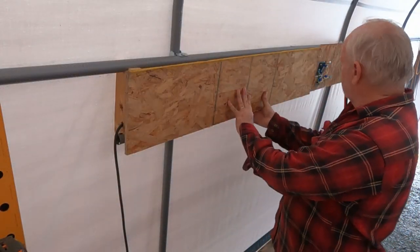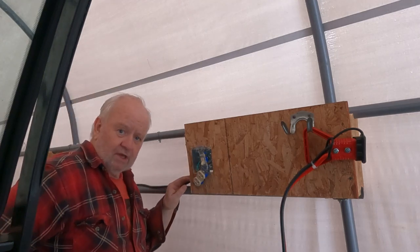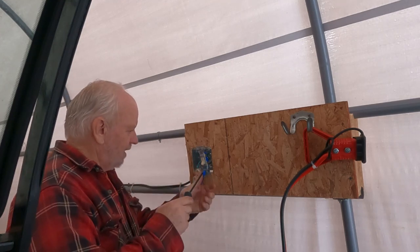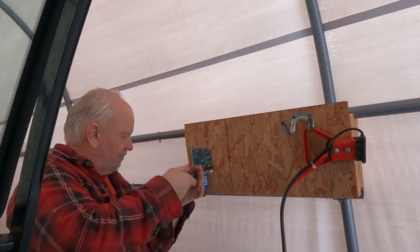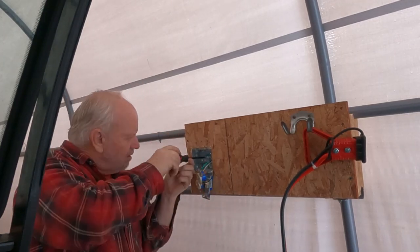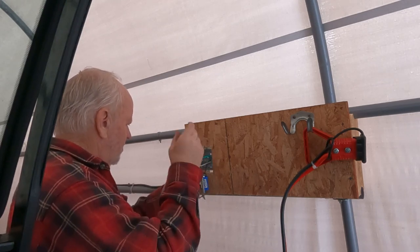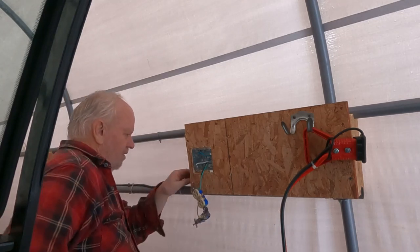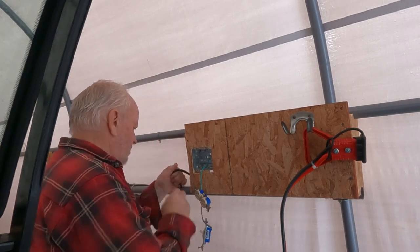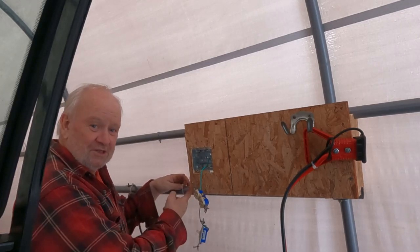So what I've done is this panel that I put in here — I had a switched outlet on it, if you can see that. I just took this faceboard off the front here so I could get at the wire. So what I'm up to now is I'm just taking this switched outlet apart so I can tie in my extension cord direct to the switch instead of through this black extension cord. So we're just taking this plug out the bottom here, removing this extension cord that I have here. Nanny must have tightened that one. We need to take the neutral off, and we need to take this switched leg off of here.